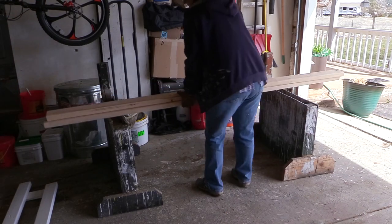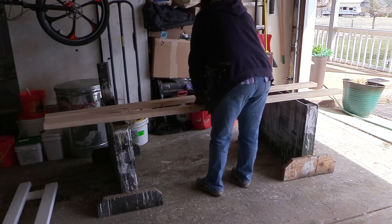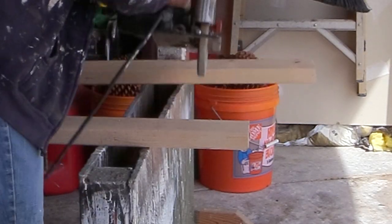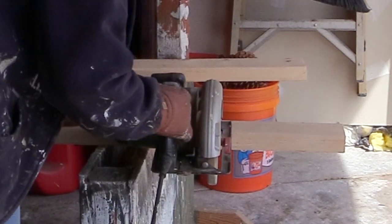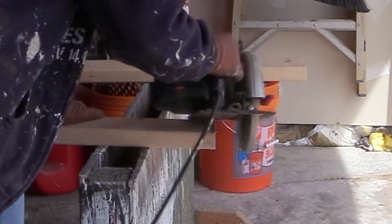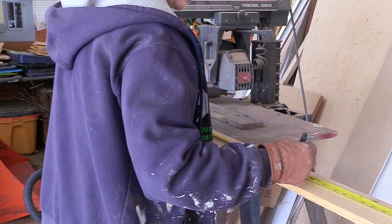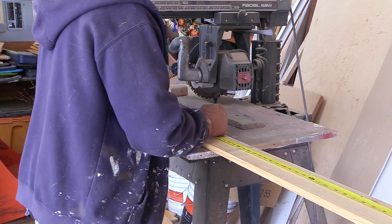For the top of the gate, I keep the two-by-four eight feet long. For the bottom of the gate, I cut off about a foot from another two-by-four, so the lower portion is shorter and won't hit the sides of the standard when you set up the gate. Then I'm cutting a piece of one-by-four lumber to 16 inches long, which will be the sides for the frame of my gates.